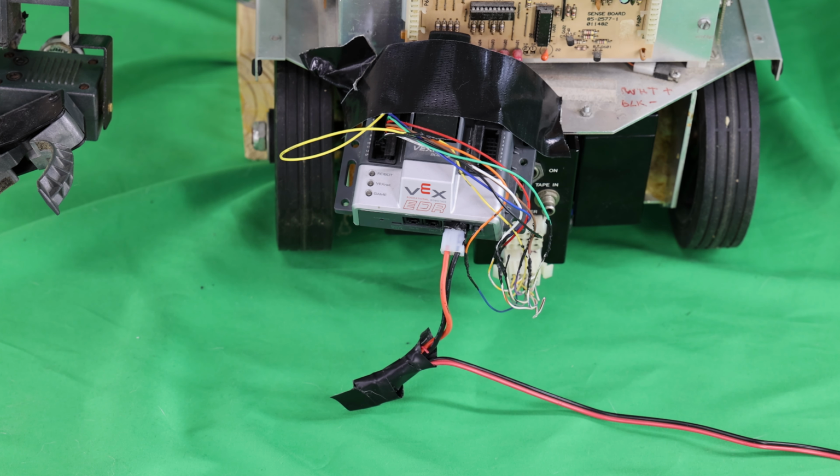But actually, if you could use the Wintec to return the ultrasonic ranger that the Hero 1 has, you'd be able to do some ranging as you're moving the robot around. So if it's going to hit an obstacle, it could stop the motors, that kind of thing. To do that, you'd have to read the sensors through the Wintec Basic, and take that telemetry and incorporate it into your own controller.